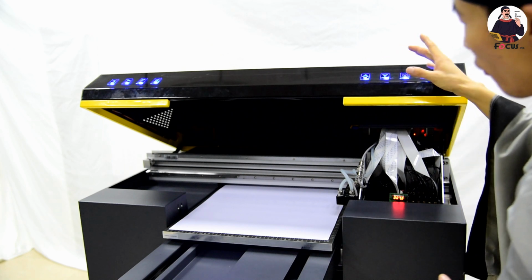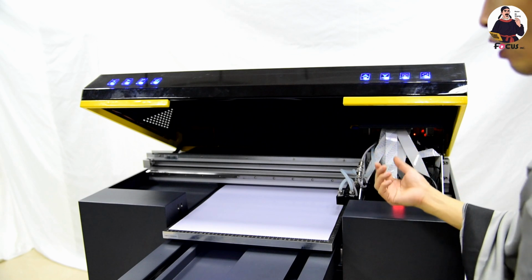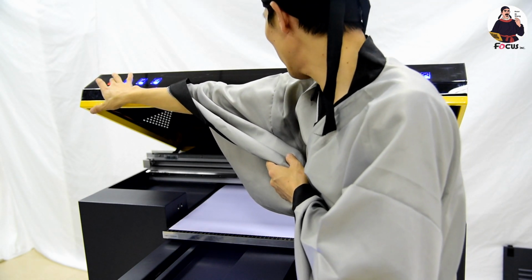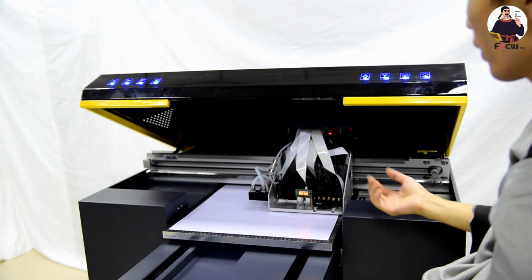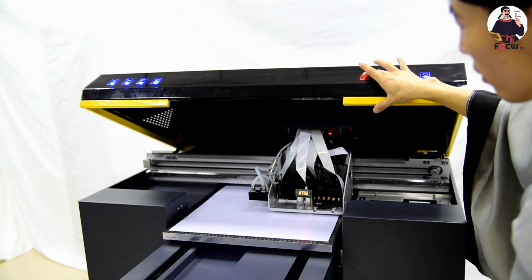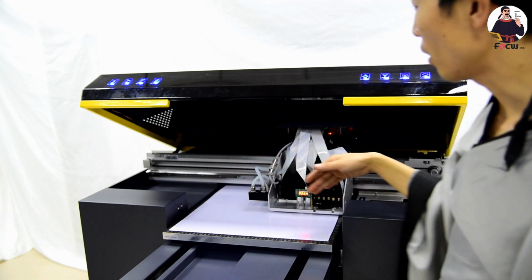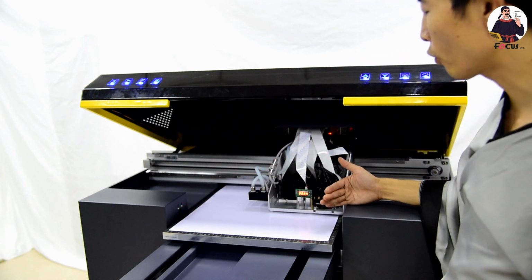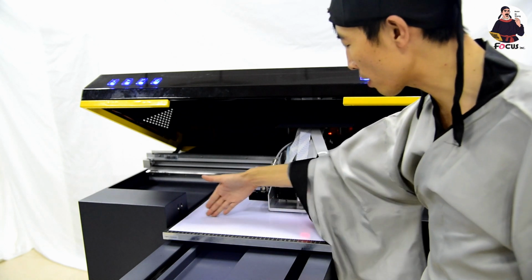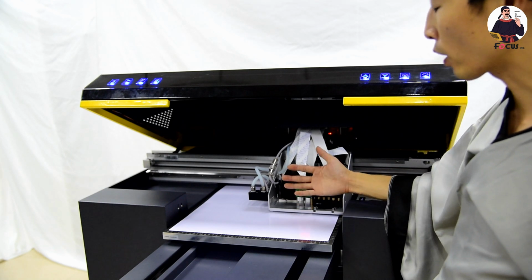First we move the carriage out of the home position. We can do it by software, or we can also do it by finger. So move the carriage out of home position. Then we first push down and then push up. Remember the sensor is from here and here, so for all the media you want to detect, you must move the material to this position, this line. Otherwise, the upper limit sensor will not work for the material.